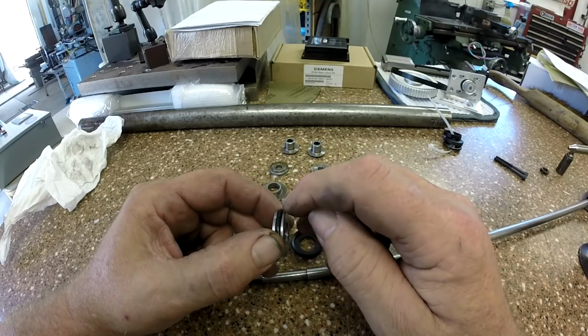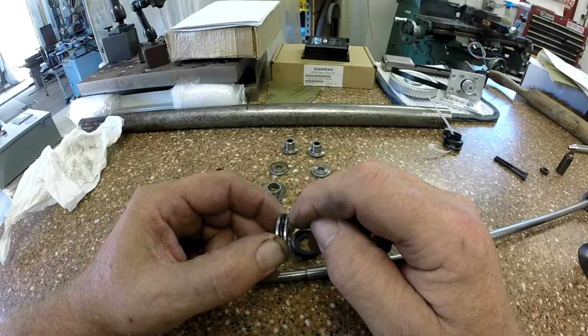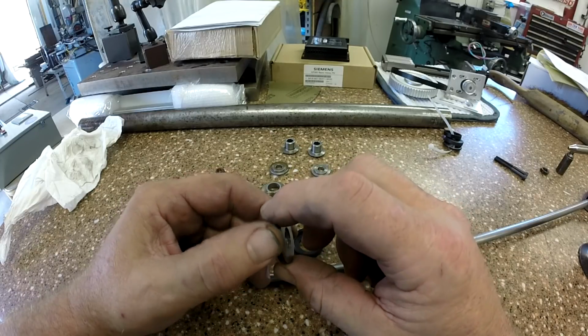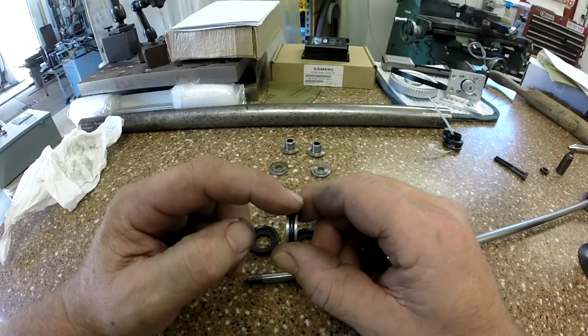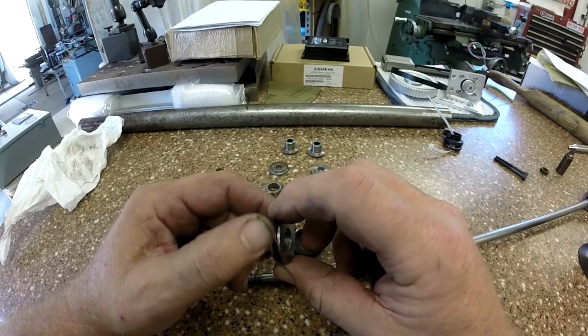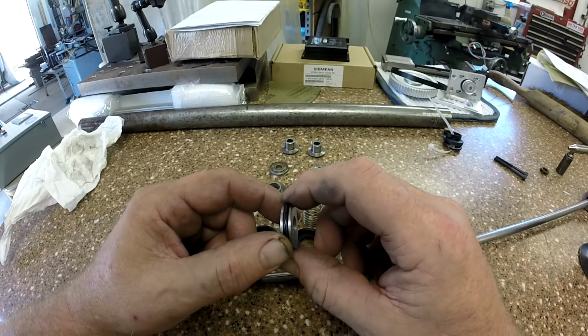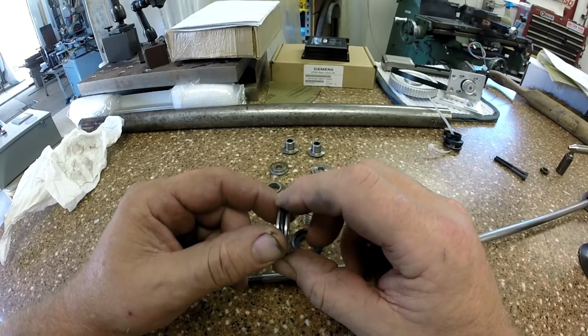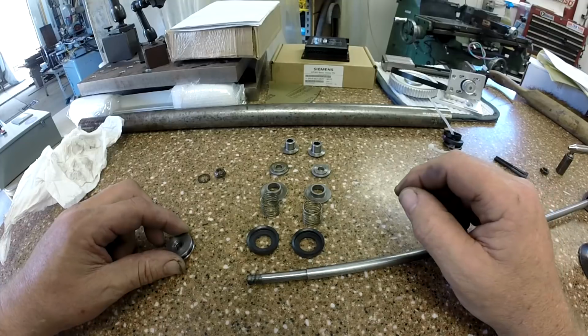That's a square bottomed hole. I didn't make a round bottomed hole, so this will deform and eventually turn into a square after it's crushed in there. But I'd rather it slide back and forth on an O-ring and create some extra friction than sit there and drag on my cylinder. So I did make a modification.